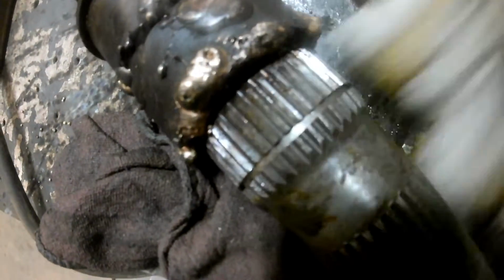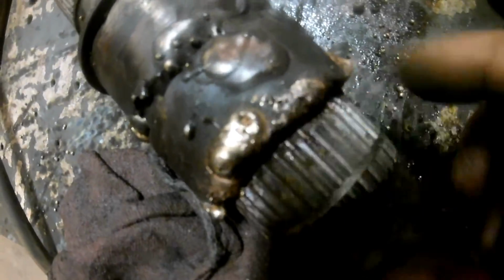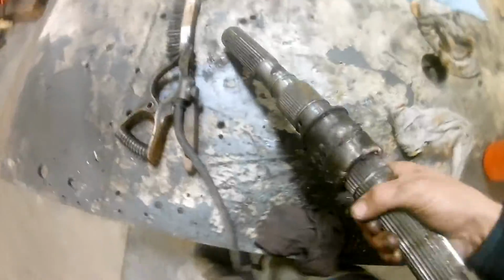But yeah, so if you're going to do that, you're probably better off taping this and sliding your cooling rags back a little bit. When you try to build your edge, the steam coming off the rag interferes with your brazing weld, but what we're doing will be good enough. I'm going to take her back here to the good old lathe.